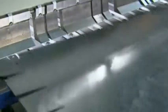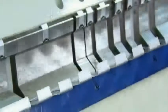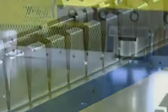They insert each panel in a powerful metal folder. It firmly clamps the sheet of metal and pushes up the edge to create a 90-degree angle. Taking a flat metal sheet and turning it into a three-dimensional object makes it stronger. They fold the notches at the top and bottom ends of the panel, and also die-cut a large hole for the clean water inlet.